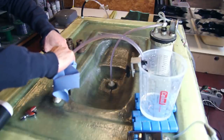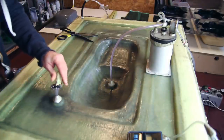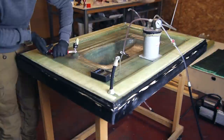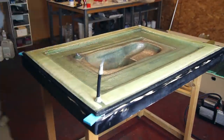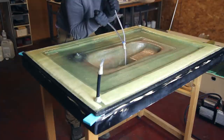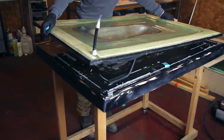At this stage I decided to stop feeding resin in while the vacuum side kept pulling. Normally for a good infusion you want some resin coming out of the vacuum tube — in this case it didn't happen, so it was hit or miss until demolding. Eight hours later I was able to demold. Normally I use 80/20 slow-to-fast hardener giving around 24 hours curing, but I tried to go faster. I started noticing the part wasn't stuck, but the flange was — and I began putting wedges under to try to break that seal.